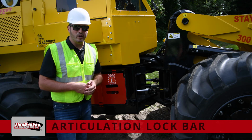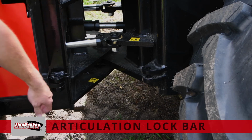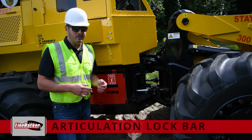Once you are pulling off of the trailer, just be sure that after you undo your straps, you take that articulation lock bar and swing it back into its operating position and safely pinned out of the way so your steering isn't affected.